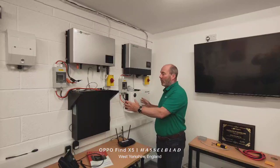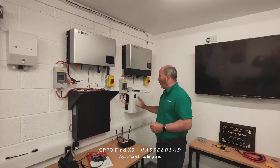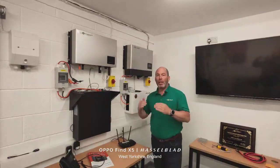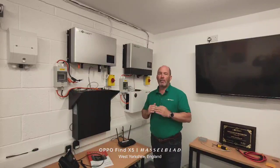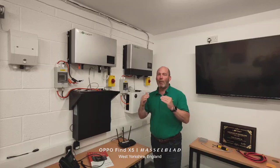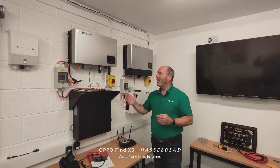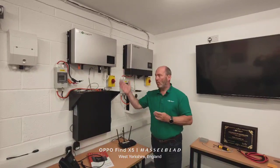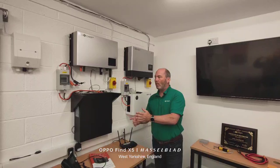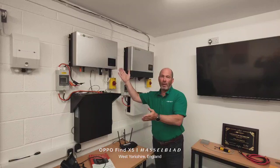Once you've ordered the new battery, if you're going back and adding a battery to an existing system — whether it be the U-Homes or the GreenLinks — when you're adding it, your installer needs to check that the voltages are similar. You can't have more than about one and a half volts gap when adding a new battery to an existing set of systems. You can just look at the screen — what's the voltage of the existing system? Then take the new box out of the box, connect that on its own to the unit, and check the voltage. That's one way of doing it.